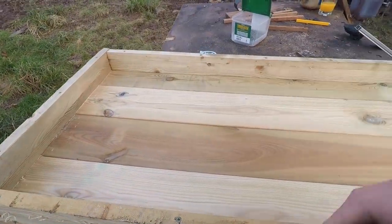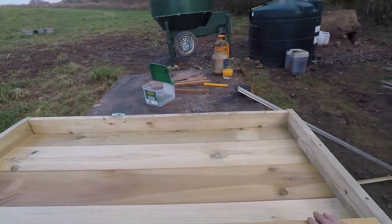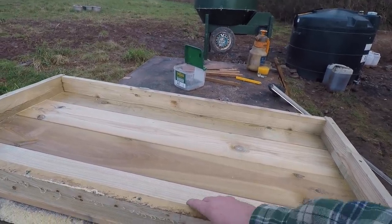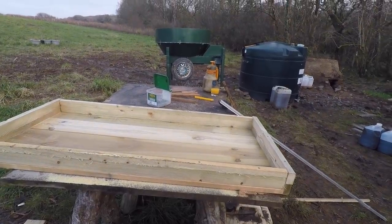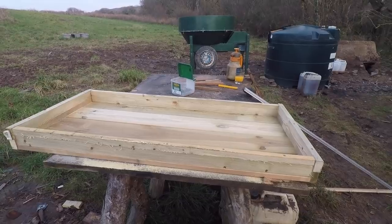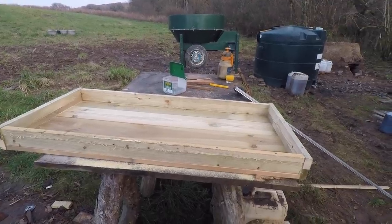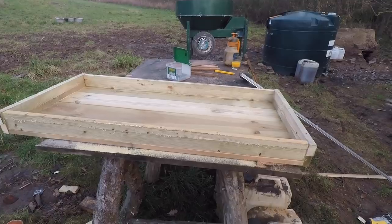We want quite a bit of copper in there. So this is probably about half a square meter, I think, which means, if the sun's shining on it pretty efficiently, we should see 500 watts of heat energy into the tank. So it will take most of the day to heat a full tank up to a really hot temperature.